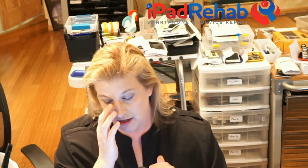to be like, hey, you know how we could make some money? Nobody wants to pay $19 for a wire. So how about this? Why don't we make our own little fake E75 that doesn't have to handle all of the signing of data pins and all of that stuff? All the E75 from China has to do is just say, I'm a legit cable bro, you can trust me. And that's what it does.